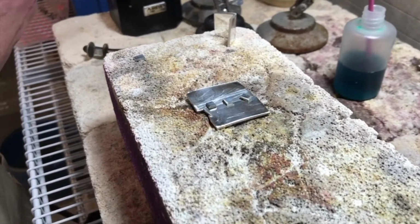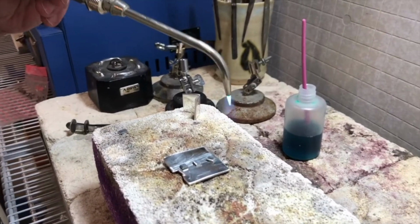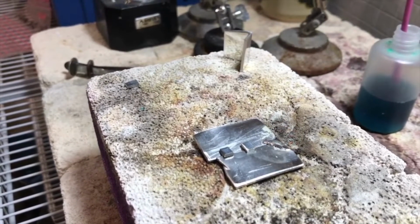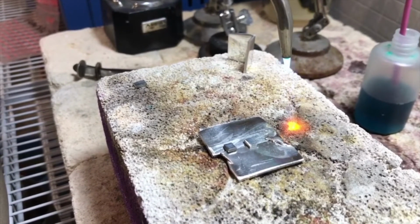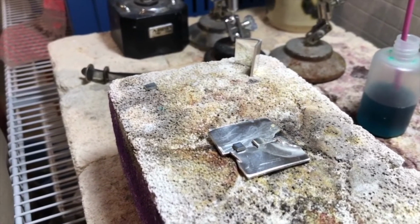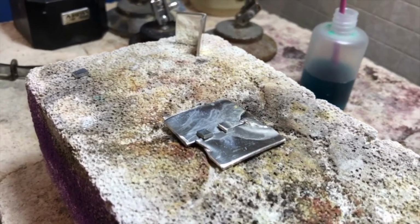As it's heating, you'll notice that it's very localized. And with using a hotter torch like this, you really have to move quickly. So you want to get in there, melt, fuse those sides together, and then get out of there before it completely sinks. Now you can go back in and remelt slightly to get it to flow in, but you do risk the heat spreading, because at the welding point you're essentially liquefying the pewter, and really causing the whole piece to collapse.